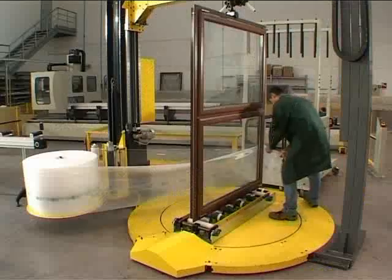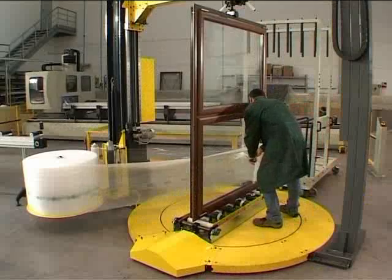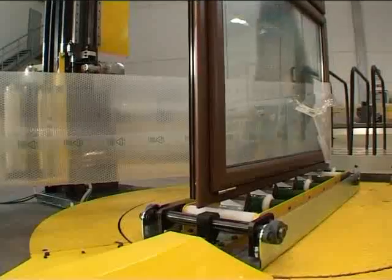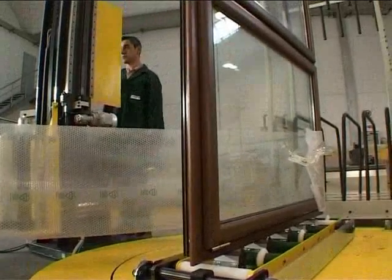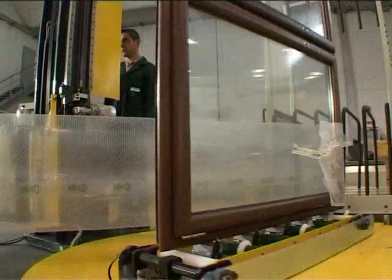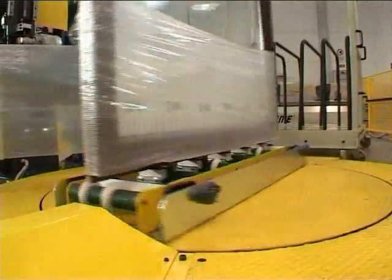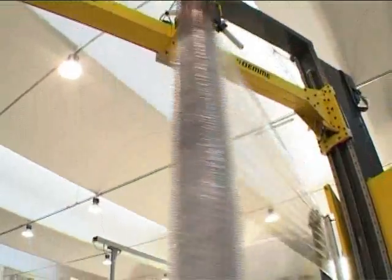You can adjust the rotating speed of the turn plate and the lifting up and down speed of the coil's trolley by an inverter. In this way, the operator can pack the fitting, choosing the most appropriate number of windings, thanks to the PLC screen set on the switchboard panel.